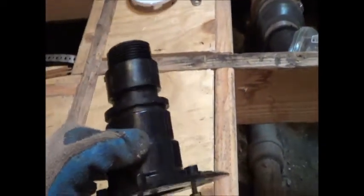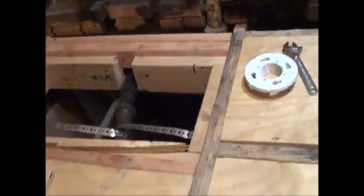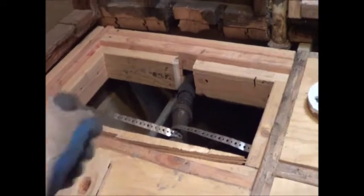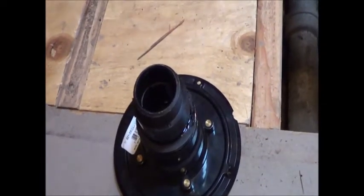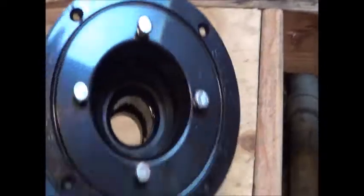The bathroom renovation rolls. All right, you can see I've done the cutting and adjustment I need to get the proper height, so this is going to sit flush on top. So I'm going to go ahead and prepare my 3/4 inch plywood insert now, and once I get the hole cut out, I'm going to screw that in. This is a screwed connection to the bottom, and then I'm going to set this lower flange for the shower drain.